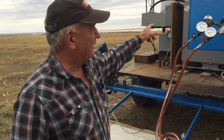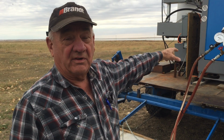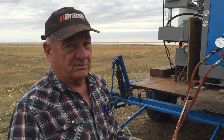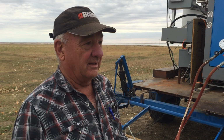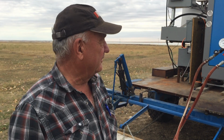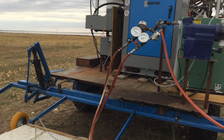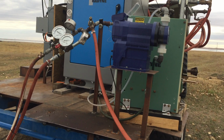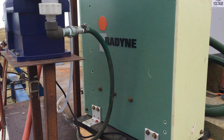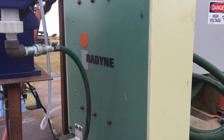Like, we will turn that on, and we were up to like 350 degrees Fahrenheit within a matter of less than 20 seconds. So it's really quick, but we're only heating up 2 to 3 ounces of water a second, and that's the secret. So we're able to make instant heat or instant steam. And so it's the green box here that's the heat exchanger unit, and there's just a whole lot of different lengths of area in there to get the heat exchange happening.